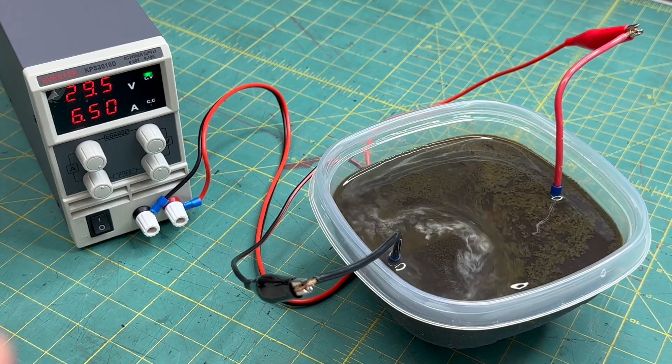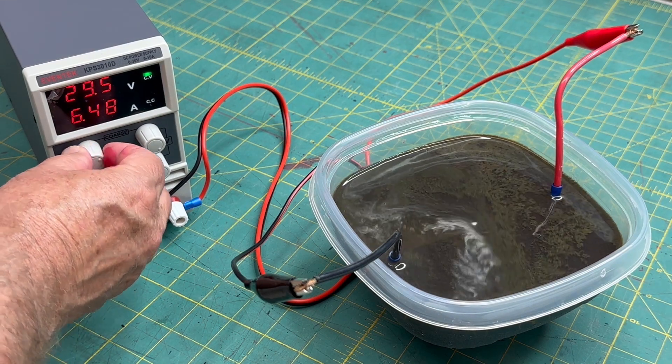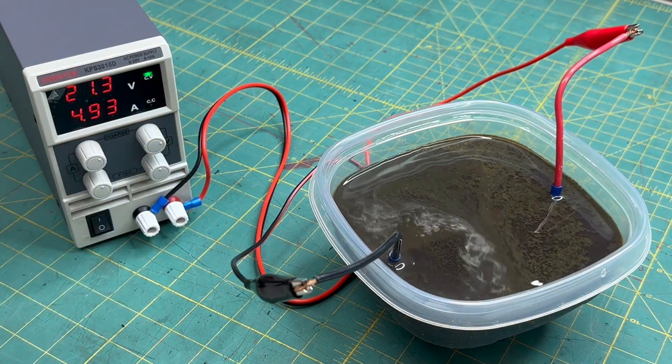But there's a problem. It works great at first, but in less than a minute the water turns so dark you can't really see what's going on. This is a combination of the food coloring and the intense corrosion of the copper electrodes. The current and potassium solution just etches off chunks of copper into the water. The copper in the water just adds mass, and in addition to making it hard to see, it slows the whole thing down.